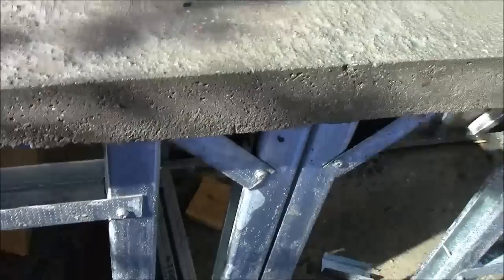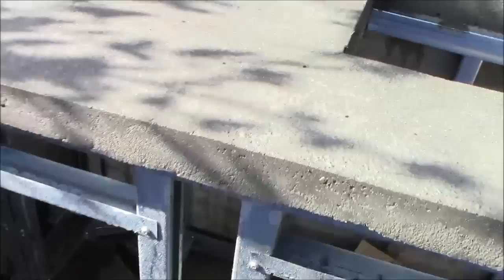Here's a look — we took a quick break from grinding. You can see how the aggregate, the stone, is starting to come out of the concrete. Those little colorful stones are really pretty, and it's becoming more smooth here with the number 50. We also did the front edge a little bit. You can also take the grinder and round off the corners if you want with the number 50 — it's that strong. You could round off this edge too, but I'm just going to leave it at a sharp 90 degree.